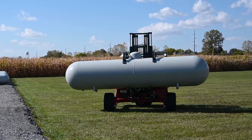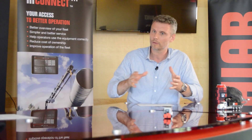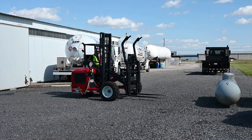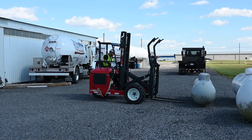If I've got a truck mounted forklift in my yard with this LPG tank attachment clamp, can I also use it for other means — perhaps moving pallets? Absolutely. We've designed this attachment so it will not interfere with the traditional forks on the machine, meaning palletized goods or other goods can easily be handled by the truck mounted forklift as it generally would without the attachment. The M4 series range has a capacity up to 4,500 pounds and the attachment has no negative effects on that capacity.